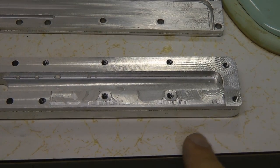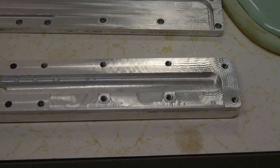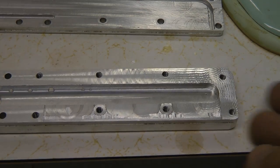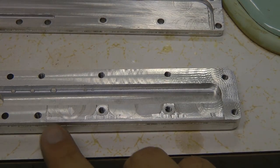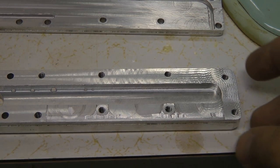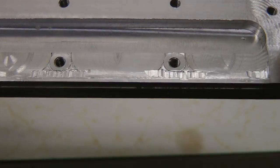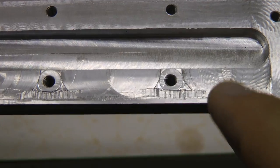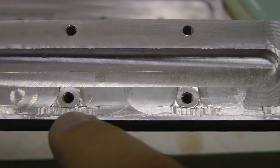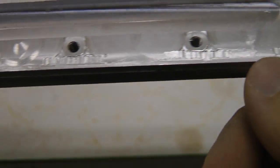It took a few attempts to figure out the right thickness. I initially tried 1,000th of an inch, or about 25 micrometers — that was too small. I then remade it to 100 micrometers — that was too large, there was too much air flow. So I eventually settled on 50 micrometers. After milling it down a few times, I eventually wasn't left with enough material, so I had to mill it down and dremel out a little bit so that the air can get into the nozzles properly.